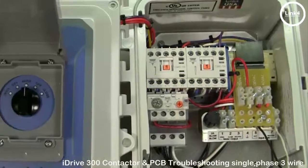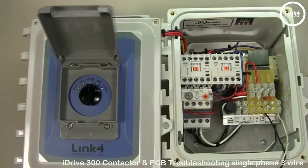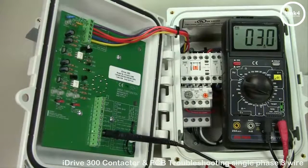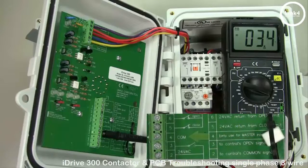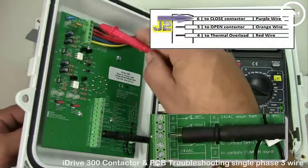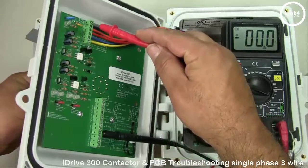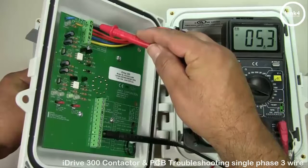Finally, test the PCB board on the back of the iDrive door's manual switch to verify the manual switch is working. To test the closed signal, put a meter lead on J1 COM and one on the J2 purple close wire, then manually position the switch to close. You should be getting 24-volt VAC. In the off and auto positions you should be getting residual voltage.